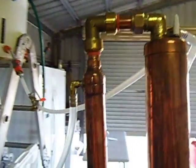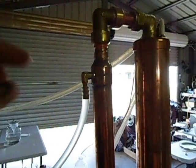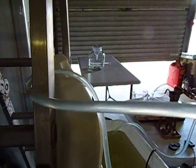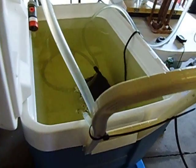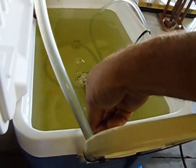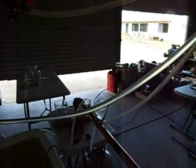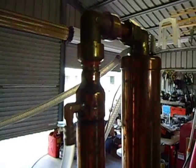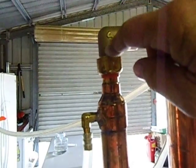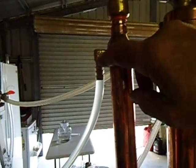Just going to come around, and this one Gordon — top of your column — that is your outlet. That just returns back to the esky. Then you can see the water flowing and let it return. That is where your vapors go through, coming through and then cooling through the vertical condenser. So that is on the outlet — it goes back to the esky.